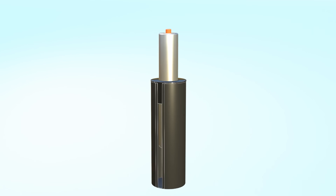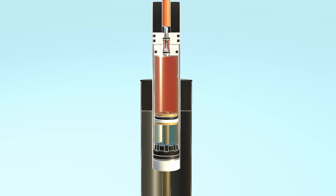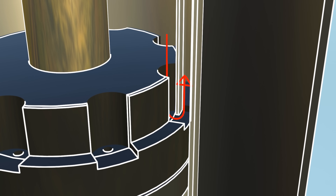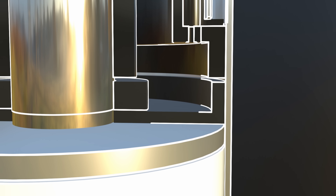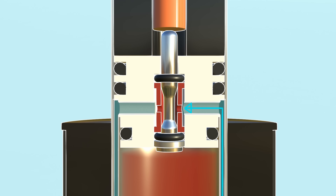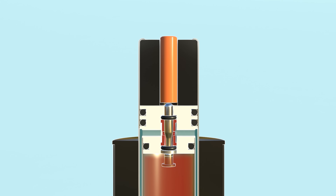There are two chambers: one above the piston and another one below it, which is always open to the outer sleeve. There are just some holes on this bottom piece of plastic. These holes also go down to a weirdly shaped rubber ring that is fixed to a metal washer. These two chambers are connected at the top with a bidirectional valve. You can open it with the handle connecting the two chambers, so the gas never actually leaves the cylinder - you just release it from one chamber into the other.